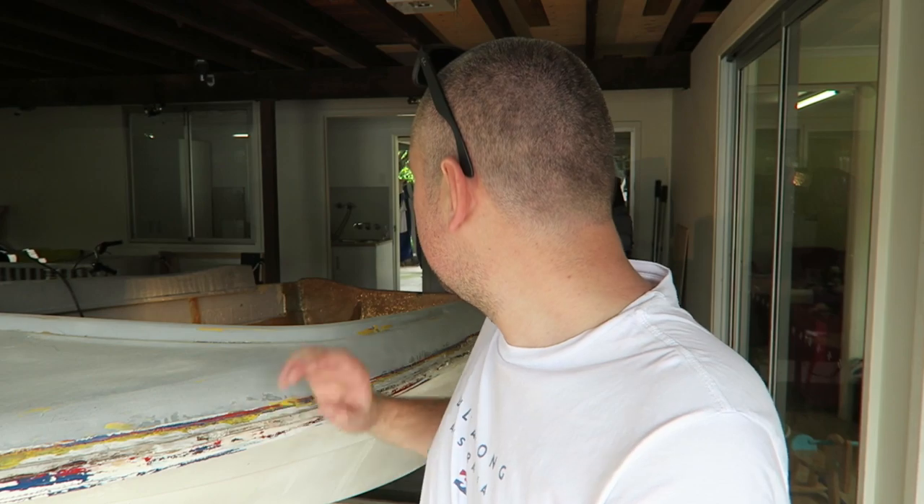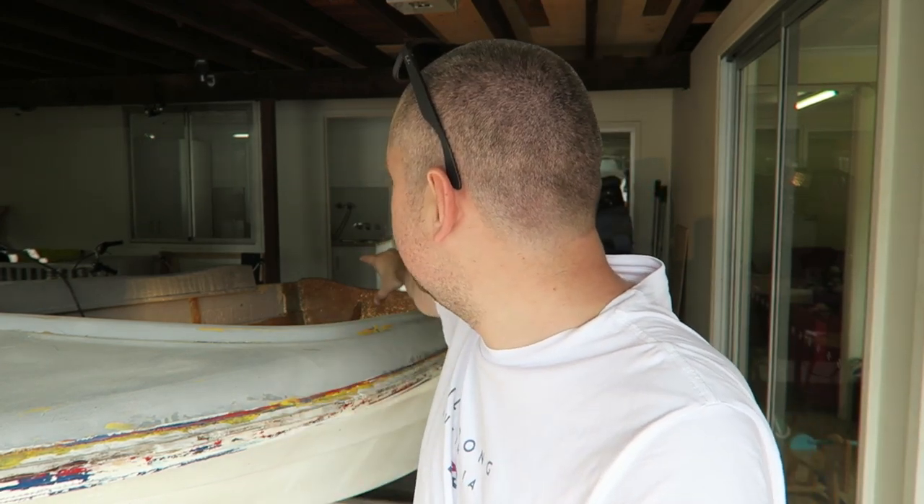It's currently early July and I have just completed glassing in the transom. We've done probably three coats of 300 gram chop strand. And then maybe four or five coats of 450 gram double bias actual stitched cloth. I've also cut small sections to basically tab in each section over and over again to different points so that I can get multiple layers, get it really thick and strong.